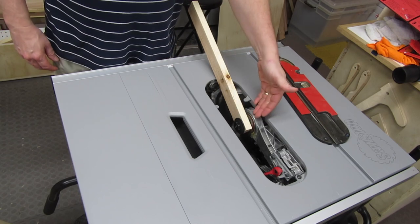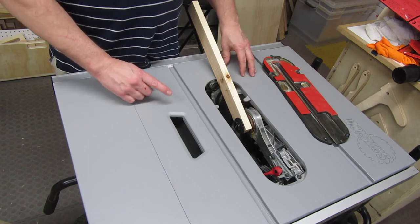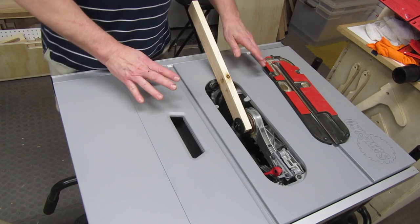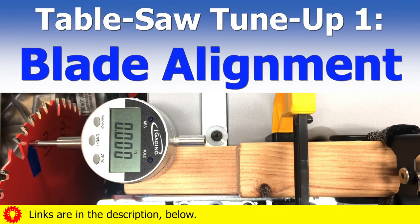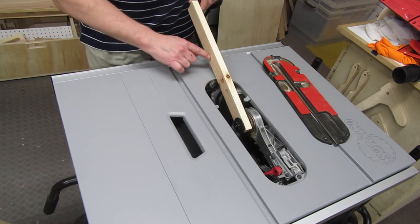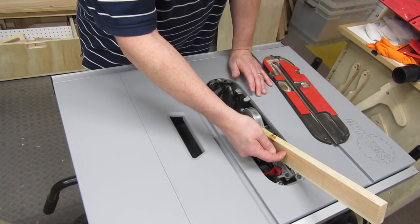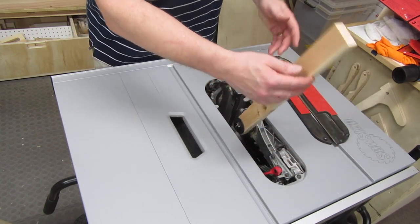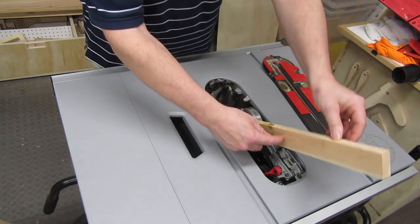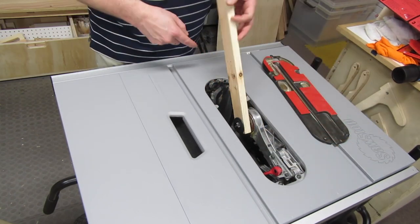Since I did so much mucking around here, I wanted to check the alignment of the arbor to the miter slot. I actually did this off camera — it was out of alignment, so I put it back in alignment. The reason I did it off camera is because whenever I do things on camera, I've got too much focus on the camera and not enough on what I'm doing. Let me show you the technique. If you've seen my table saw tune-up part one, this is the same technique. I've replaced the blade with a board. I've got a line drawn down the middle. If I measure the distance here, then rotate it over and measure there — if they're not the same, it's out of alignment. If the board isn't straight, it doesn't matter — even a curved board will give consistent readings as long as you measure from the same spot, because you're measuring the arbor's relationship to the miter slot. With the blade you can only measure right here, but with the board you can measure clear out to the end — it's easier to see the difference.